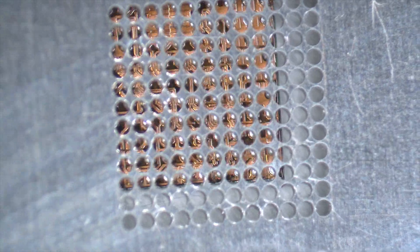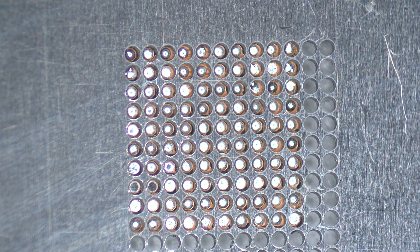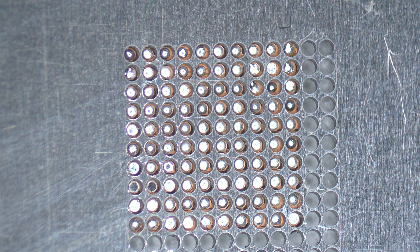To rebuild this circuit, first of all, we solder at 350 Celsius degrees. To remove the excess solder, we use an economical stencil. For this process, we have used 180 Celsius degrees solder paste.